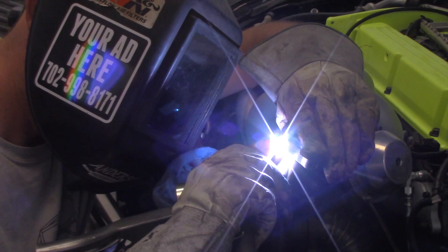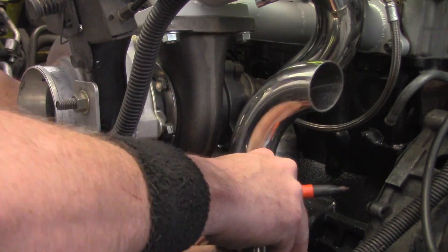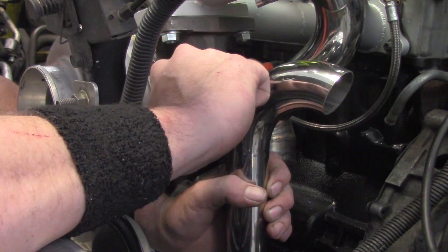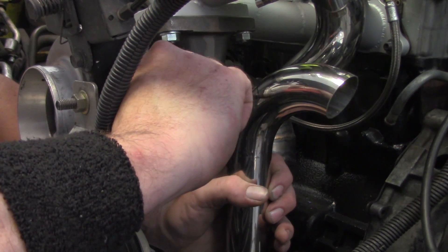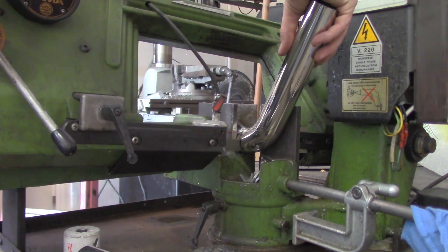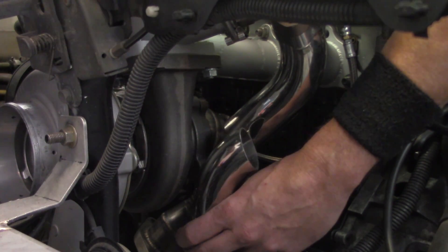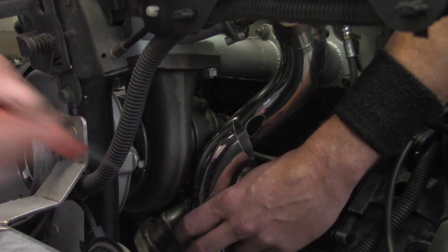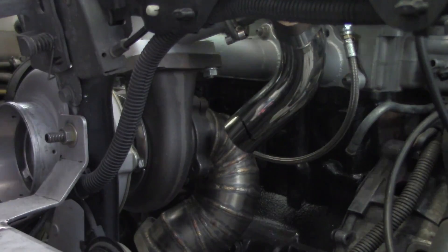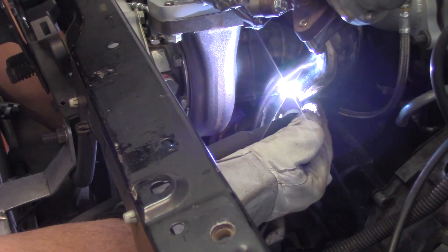This is kind of a temporary workstation that I'm setting up right here. You just clamp it to the car, make sure you don't scratch it, put a rag underneath — works out fantastic. You don't have to go back. I'm going to butt these two up parallel or inline right next to each other so I can get a rough cut guess on this angle. Stick it in the saw, chop that down. It's just a little bit too long yet, so I hold it up here, get a general idea about where I need to cut it, get that cut down to length, and then tack it back on.